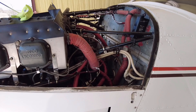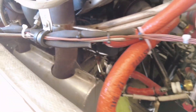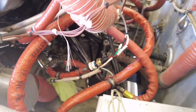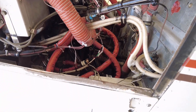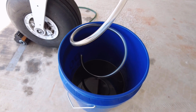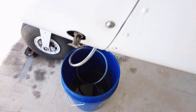Here's what we've done: we have about three feet of clear tubing hooked up to drain the oil. We use clear tubing because as the oil starts to drain, you don't want a surprise when it starts blasting out of the end into the bucket. We captured our sample for lab analysis first and then proceeded to let it drain overnight.